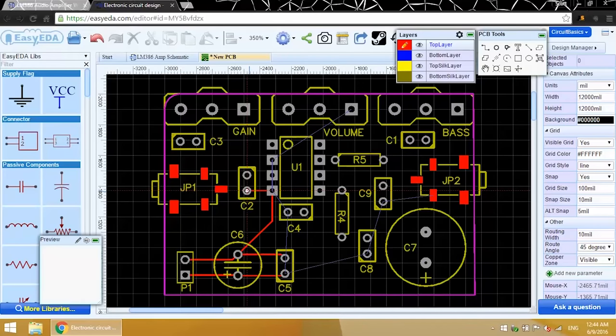The traces in EasyEDA bend at 45 degree angles by default. It's kind of an industry standard, but it can be important if your circuit uses high-speed digital logic. I'll explain more about that in a blog post for this video, which I'm going to link to in the description. I also go over more tips and tricks for designing the PCB, so check that out if you're interested.